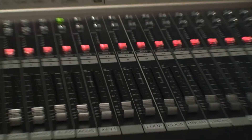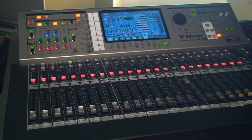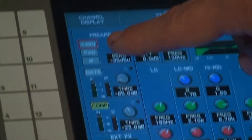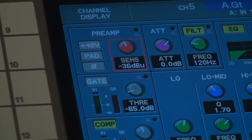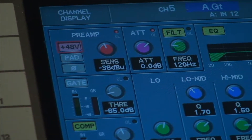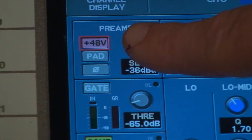If I look down on stage and I know that the acoustic guitar player's direct box requires phantom power, I've got to turn on the phantom power. If you look in the left side of the screen on the display, you'll see 48 volts. You would use the arrow pad and arrow over until you highlighted 48 volts and then press enter. That's going to turn on the phantom power and send a signal to the direct box or the microphone.